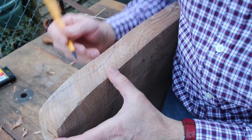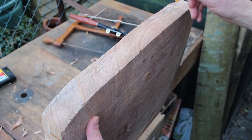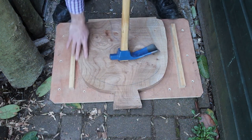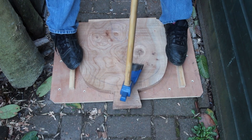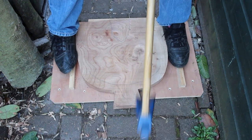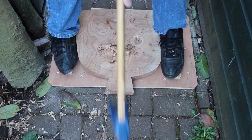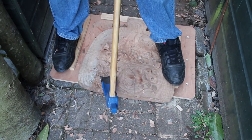I don't have to be rigid about this but I don't want to go too deep there, so I'll take out that material in the hollowed areas. I'll even this up later but it gives a good idea of what's coming out and what's not. Some of the heavy work can be done with this big adze. I've got a bolt that I've knocked up for holding the seat securely without it being too dangerous an operation for your feet, so I'll just do a bit of chipping at this.